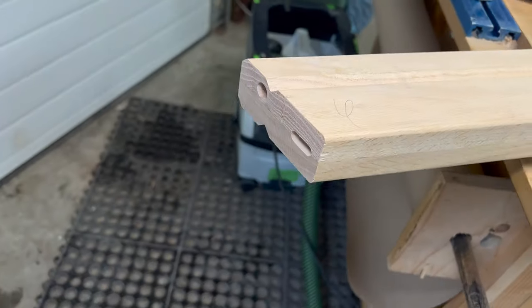Here I've got the railing laying on the nosings of the stair. This is how we know we used the right angle and calculation on the top, because that horizontal piece of railing that's a foot long is sitting nicely on the second floor hallway and the railing is sitting perfectly on the nosings of the stairs. If there was a newel post here, this angle cut would be 38.75 degrees — we just divided 38.75 in half. We're going to fasten this onto the brackets so that the seam is roughly in line with the point on the top nosing.